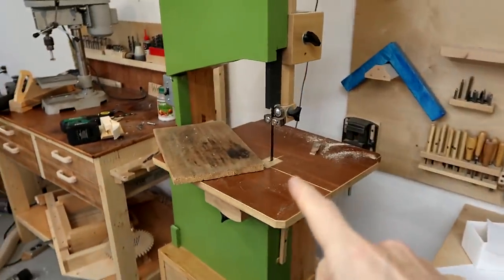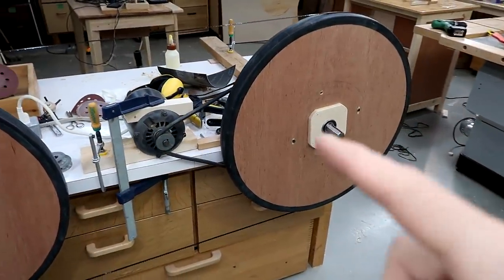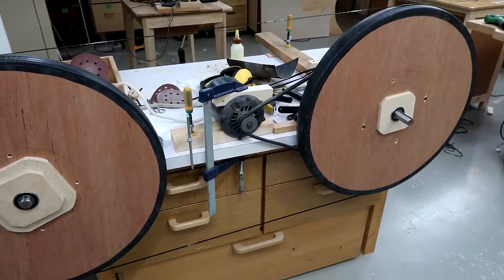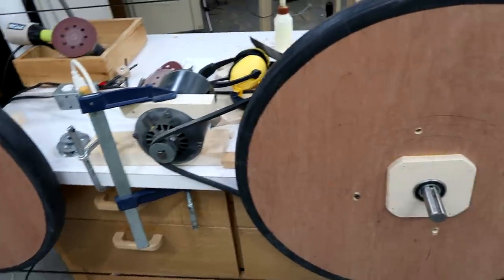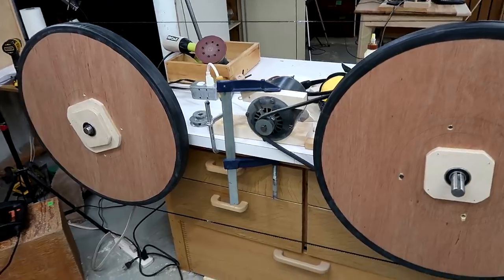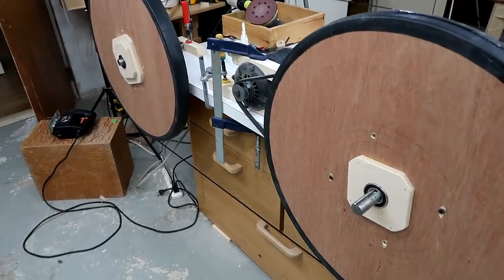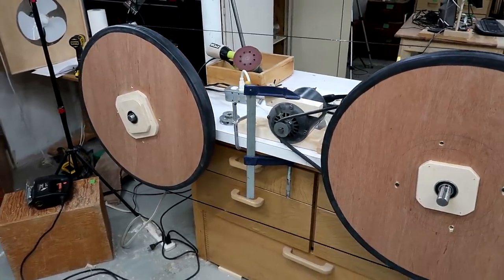I've only got half a horsepower in this one, and I use it for cutting fairly thick stuff. Since I'm not planning on doing any saw milling with this bandsaw, it should be enough. For saw milling, there's really no need to go to wheels that size because you don't need that throat depth — I'm not going to cut a piece of lumber 26 inches thick. Realistically a Wood-Mizer has about 45 centimeters or 18-inch wheels, and going to 20 inches or 50 centimeters is quite enough for sawmill blades. So making this bigger is all about elbow room, not cutting capacity.